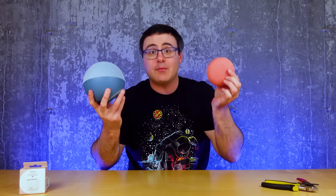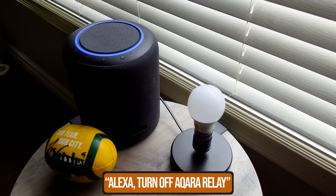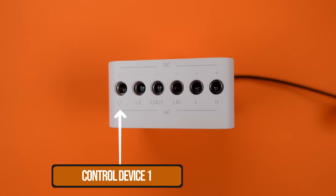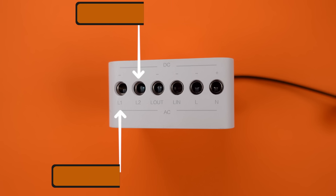Things like Amazon, Google Home, Apple HomeKit, and Samsung SmartThings can all be used to open and close the relay contacts, just like physically operating a switch. Some relays allow you to do this with more than one circuit, which is what the dual relay module means — it allows you to control two circuits. When you see it show up in the Aqara app, it has two separate controls you can name independently, so if you stick this behind a set of light switches, you can name each one for the different lights or things it controls.